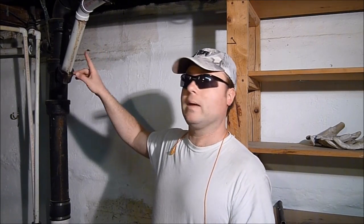Real quick before I finish — your cast iron pipe goes over here, up the wall, and up through the roof; that's your vent pipe for your plumbing. So don't just start cutting cast iron pipe without making sure the remaining pieces are strapped and held in place — whether it's the pipe going up the wall or something else — because you don't want sections of it falling down. It is very heavy. PVC is forgiving if you cut out a section, but cast iron is so heavy that if you cut out the wrong section with no supports or straps holding the rest in place, you're going to have a big problem. So do be careful, and please don't let it drop on your foot. These things weigh a ton.